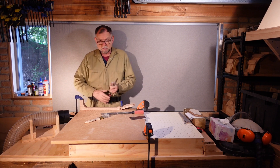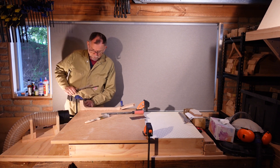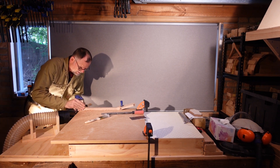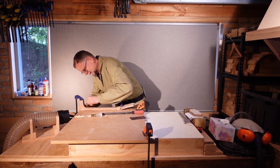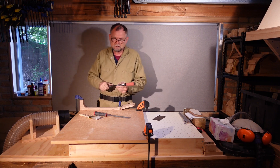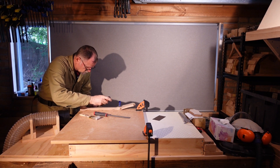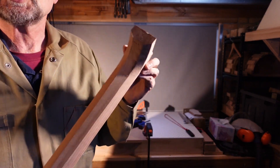I have the facet on this side about 2mm short of the target lines, but only on the flat sections. So now on the curved sections I need to use the curved rasps to blend those lines in so that they are a smooth, curving, flat facet. As I start to approach the lines, it turns out the facets are a little bit crowned - this is not the time for carving in the curve, we want flat lines. This is the first set of facets cut.